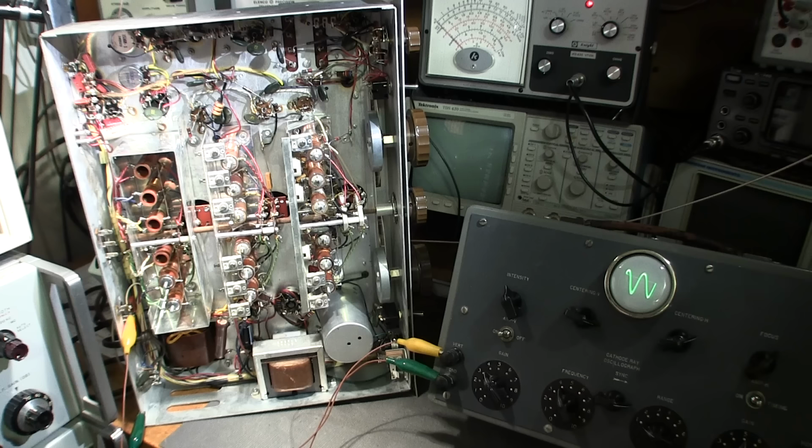So now to finish this off, I'd have to go back to the upper portion of the band and check 1.25 again, align it, and then come back down here. And if it's right on frequency, this particular alignment is done for this band. So what I'll do now is I'll remove the oscilloscope and I'll show you the same procedure using a VTVM.